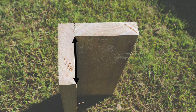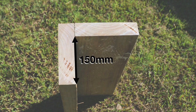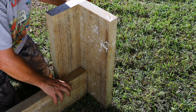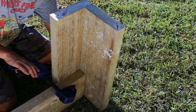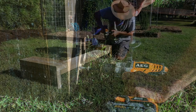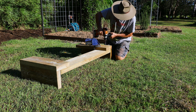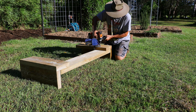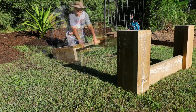When you look down at your corner you'll see a long and a short side — one is 200 millimeters, the other is 150 millimeters internally. Position a 1.2 meter length of sleeper flush in the corner, flat against the short side, lightly clamped and adjusted to align with the bottom edge of the corner block, then join with two 100 millimeter screws. Position and clamp a corner block on the opposite end, ensuring the short side is flush with the sleeper. Secure with 100 millimeter screws and repeat the process to create the other end.